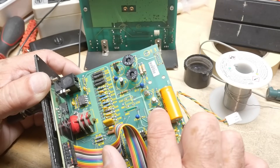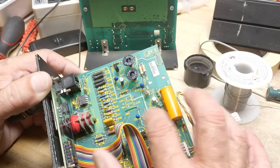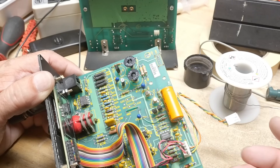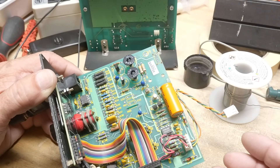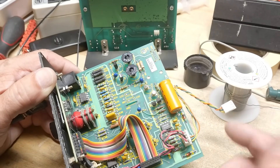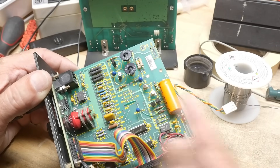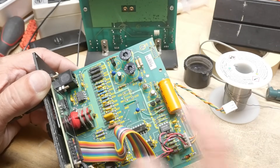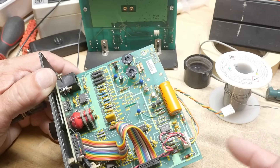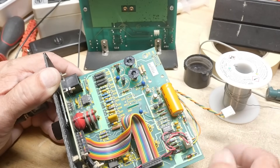So there's a plus two and a half volt reference, a minus two and a half volt reference, and some other ones. It generates 3.75 volts in some odd fashion to power up the digital circuitry. The digital circuitry is not powered at 5 volts — it's powered at 3.75, and it goes through a resistive divider to get to that voltage. I don't quite understand why they had to do it that way, but they did.